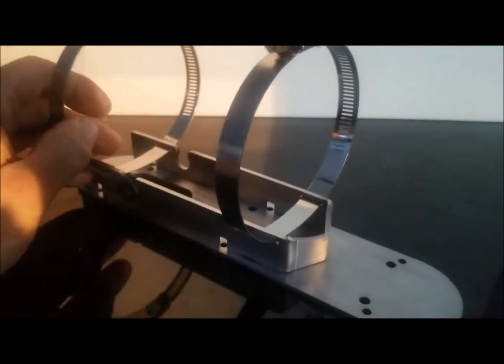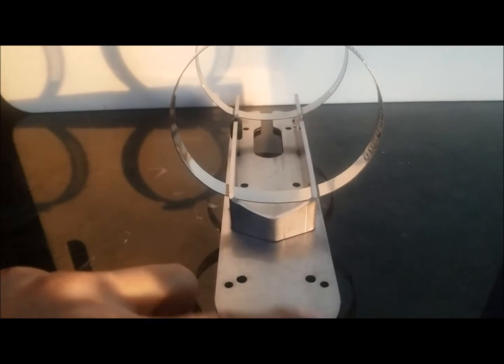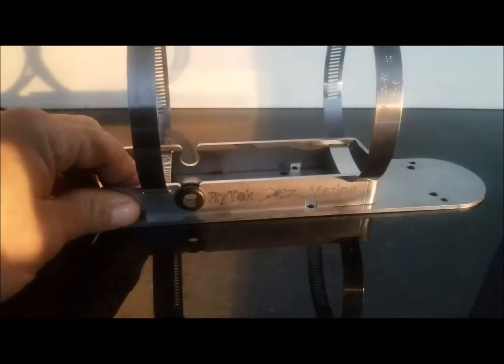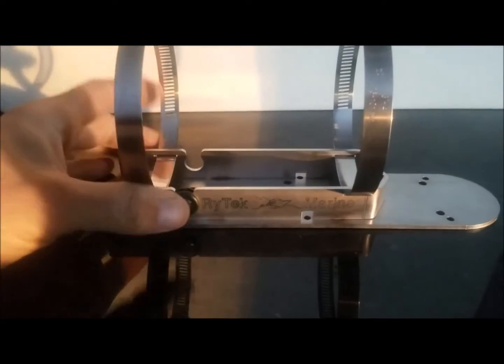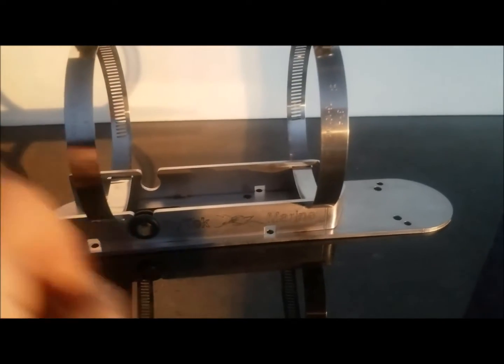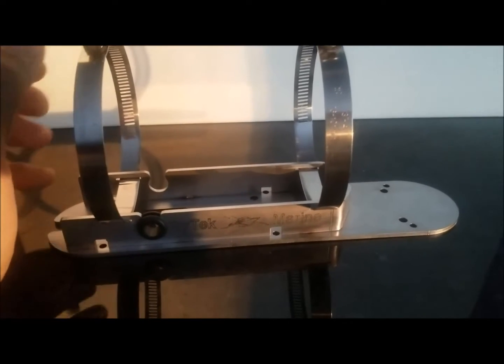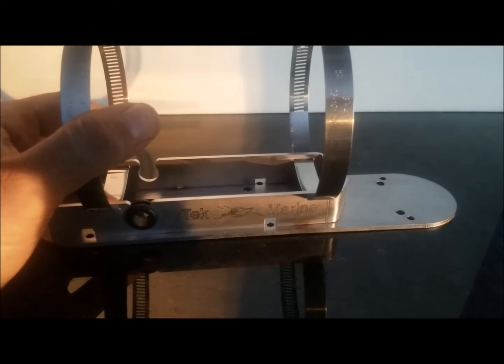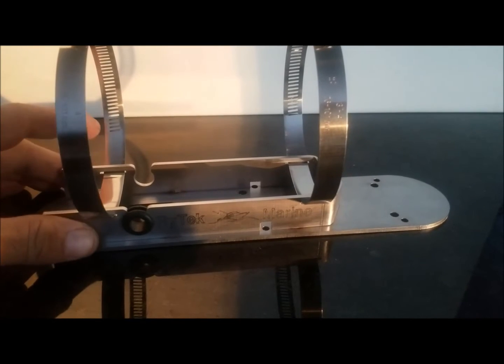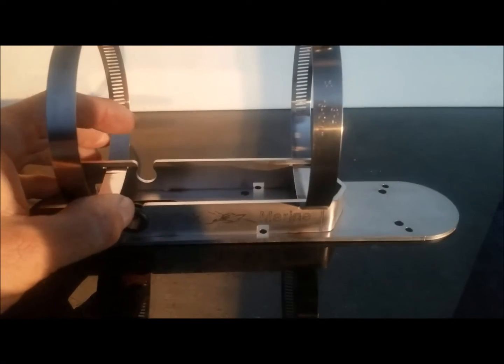For the holes, like I just mentioned, the inner holes, the holes on the inside there, those are going to be for the total scan and the new transducers. The LSS1 and 2 are actually the outside hole, which is right there. What happens with those is they come up right in the middle of the bracket. So you're going to put the machine screws up through the actual transducer, and then you slide your nuts right in that hole, and they fit in there nicely, and that's actually going to act like a wrench. You don't have to put a wrench on the back too. So you can just use your Phillips screwdriver, screw them up in and tighten them up, and they're good to go. So yeah, works out well.